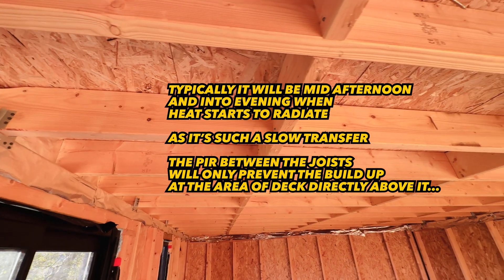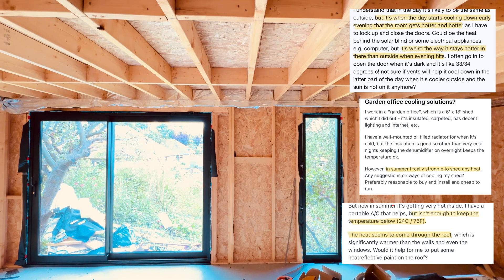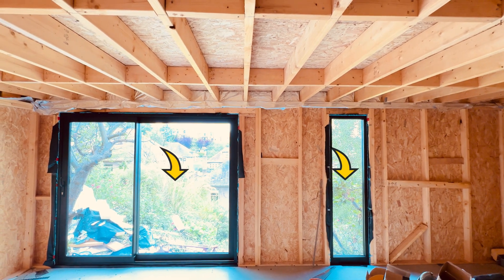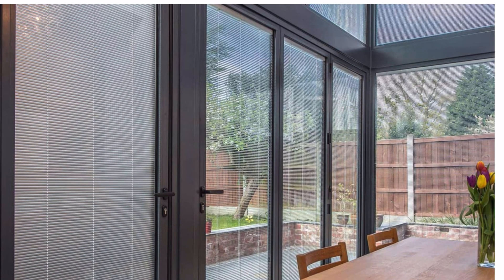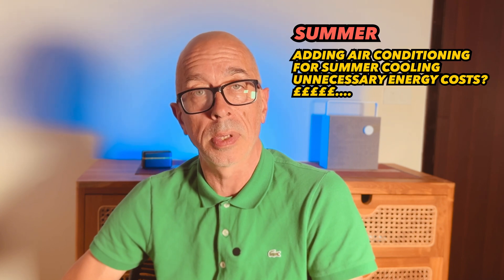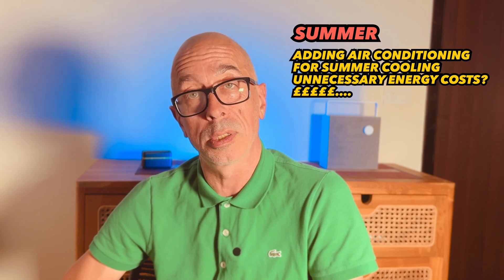No matter how many vents you have installed — if you've ever walked into an attic space in the summertime, there are no windows, no solar gain, and yet it's absolutely boiling in there. The heat coming through the timbers from the sun creates this greenhouse effect; they're like big long radiators. This is also the case for many self-build projects where roof insulation is put between the roof joists — you'll create a mini sauna unless the structure and roof surface is fully in the shade all day. That's before we account for solar gain through glazing areas such as bifold and sliding screen doors. Many double-glazed units now come with integrated blinds within the window cavity, but it won't make much difference because you're getting heat coming in every 400 millimeters. If you don't believe me about the heat, ask yourself why so many people are retrospectively adding air conditioning and cooling units to their builds, adding a percent to their overall build cost as well as an additional energy cost during the summer months.